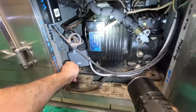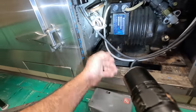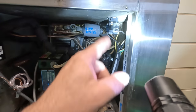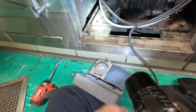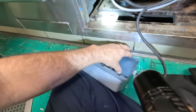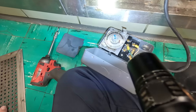Obviously it's not the defrost clock, which I made so it was actually serviceable. The last one made it very difficult — this one here is very easy to get into. I really don't want to replace that stupid thing, but I have a feeling that's what we're going to have to do. I made it so it was isolated with that contactor there to take the brunt of the amperage. The clock here is from 2019, so that's about four years. There's the clock — we're not in defrost. We're doing about a 35-minute off cycle.